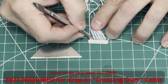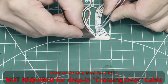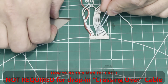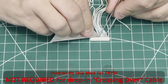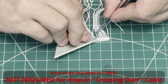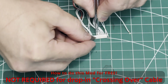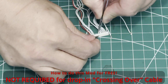So we're simply going to detach these from the connector. You do have to be ginger careful. I use a pair of tweezers and a razor knife to lift up on that locking tab, and I'm doing this in near real time in the recording with just a little bit of editing here and there where maybe I had to reposition my hand. Pulling those conductors out, being ginger careful not to bend too far on that tab.